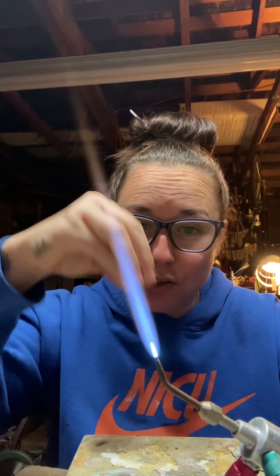I get this little baby to where — you've got to hear it too. Like now it's such a natural instinct for me to hear it and see it and know when to go. So I guess it's going to be a learning curve for us both as I try to show you guys how to do it. But this is my sweet spot right here. If you hear it hissing a little bit, it's all blue. It's probably about a little bit bigger than a quarter of an inch, almost right at half an inch. That's what I use for everything. See that really beautiful cone right there — it's a blue cone. There's no orange in there. It's very blue, it's hot, it's a straight cone, there's no fluttering in there.